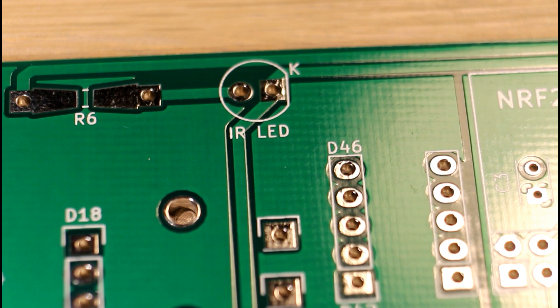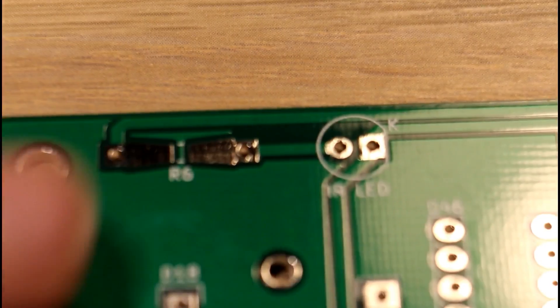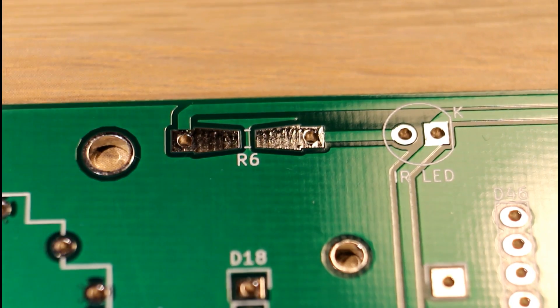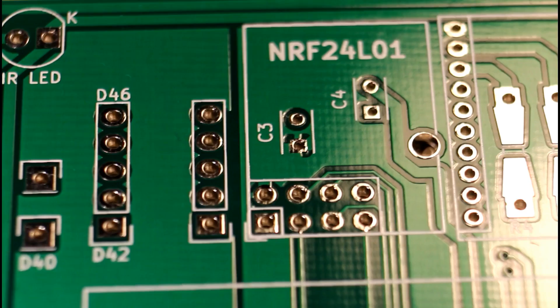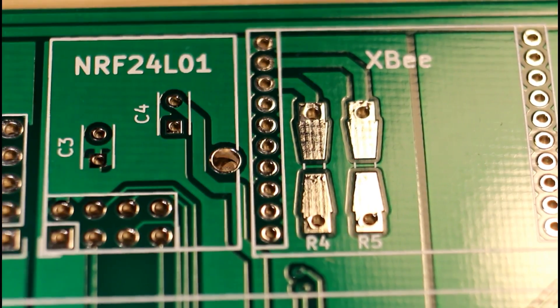You can always replace those with normal super bright LEDs and use them as a light if you're using your models in the dark — it might be useful to have a torch built into the controller. They're driven by a transistor so you just have to spec the resistors correctly. I'm using these pads for the resistors because it gives you the option to use through-hole resistors, or if you want to try SMD soldering you can also fit various sizes of SMD resistors.